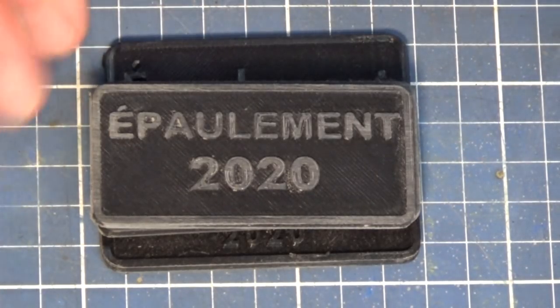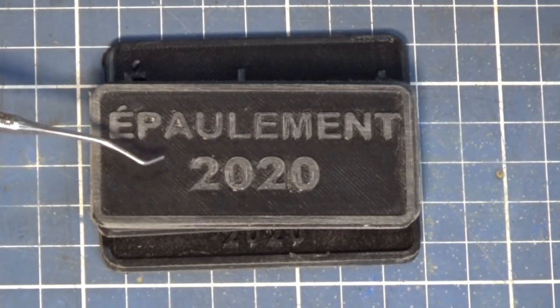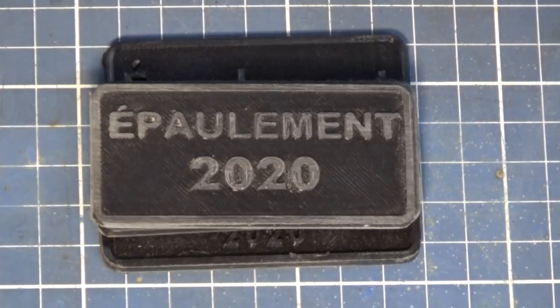Now, even then, I knew that this was going to be a problem. So what I'm planning is to make a core, like a core in reverse, out of sand and epoxy resin. Now, I've done this previously in a number of my projects and it's worked really well. And there are people out there who will say, well, that's wrong, you should use sodium silicate and sand. But I find the epoxy sand works for me and I don't keep cylinders of CO2 gas for curing the sodium silicate on hand. But the epoxy is easy to get and it's very tough and durable.